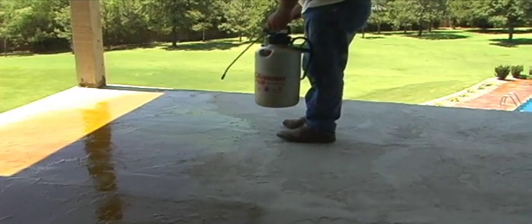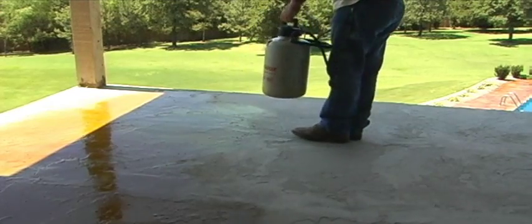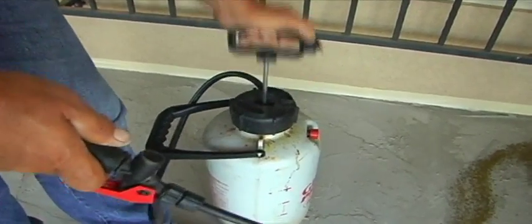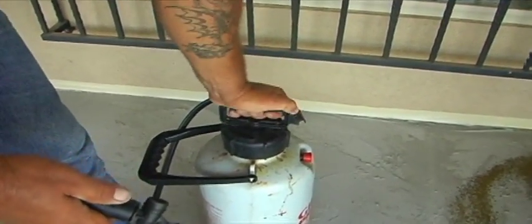Before beginning any job, drop a small amount of stain from a plastic spoon or eyedropper onto the concrete floor to determine if the stain will react. Be careful not to walk on wet, active stain while applying. Consider wearing Direct Colors acid stain resistant spike shoes over street shoes during the application, especially if spraying more than one color of stain.